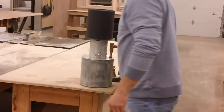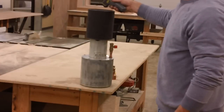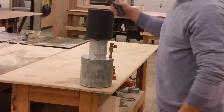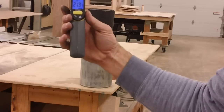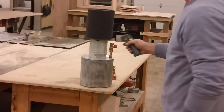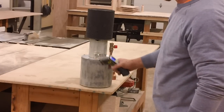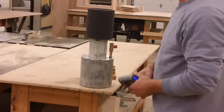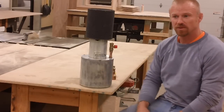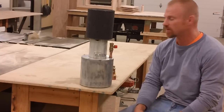It's been burning since you saw it lit up. I'm going to get a temperature reading right here in the center top — and you can see that's already 219 degrees. Down at the little stack underneath it's running about 115 degrees right now. It works pretty good. I'll have to build another one that will go inside the big 12 inch rocket stove so it can get a 10 to 12 hour burn.